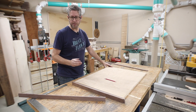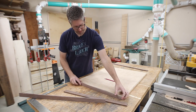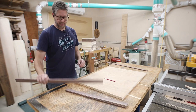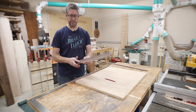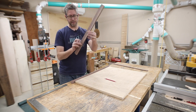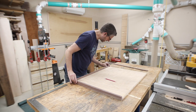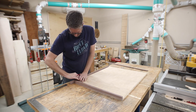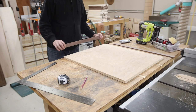For the side pieces I'm just going to use referential measurements — it's going to be easier than trying to measure and mark a spot. For the short edges I've already got those two cut, making them end where the plywood ends. For the long piece measurement, I have to account for the short edge pieces, so I'm taking both of my short edge pieces, lining them up next to the plywood, and using them as my reference mark. Everything should line up fine without having to measure.